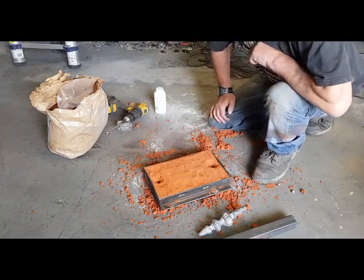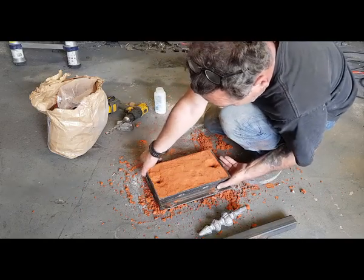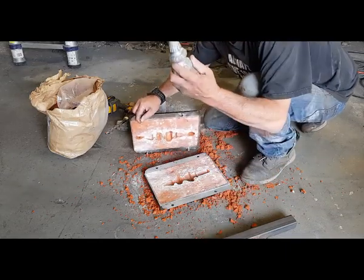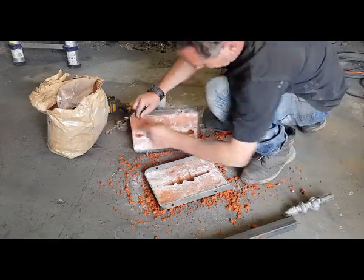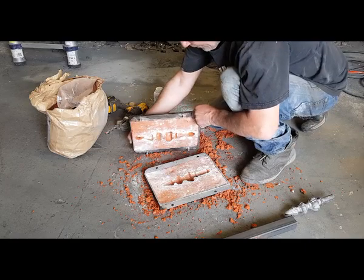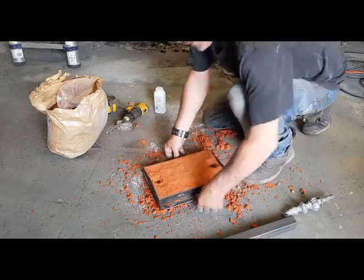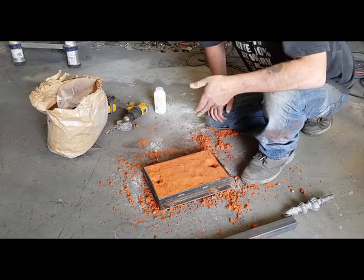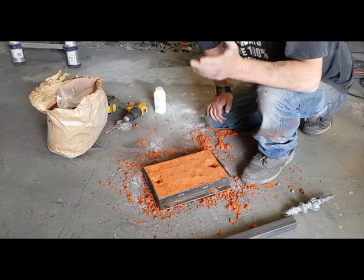For some reason the camera didn't operate, but what I've basically done is tapped this, lifted this one up, and taken the master piece out — so now it's left with a void the same shape as the railhead. Using a wood drill I've drilled two holes to let the cast iron go in and out, and then carefully placed this back onto the mold. The cast iron will go in one hole and out the other.